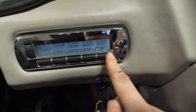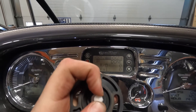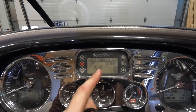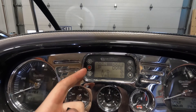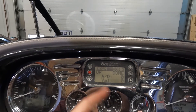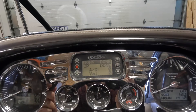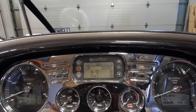Now when I try to push up, nothing happens because we are not going more than two miles per hour. To change the AD reading, you simply spin the sensor — I use pliers because it's pretty hard to do with just your fingers. Make sure you're getting an AD rating when you spin your sensor. When there was no sensor attached or detected, I believe it was giving a rating of around 560 — way higher than anything normal. The highest I've seen with it hooked up is 200. Make sure the sensor won't operate above a certain number, and set it to zero when the wedge is all the way down.